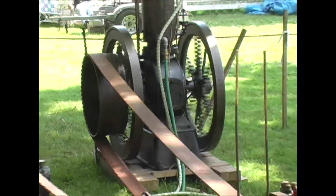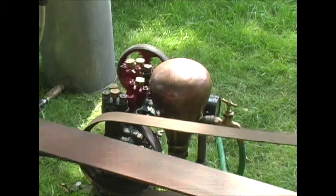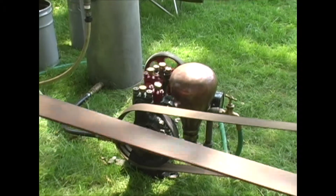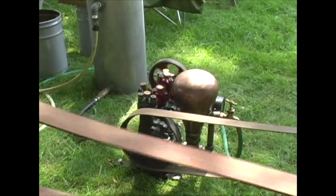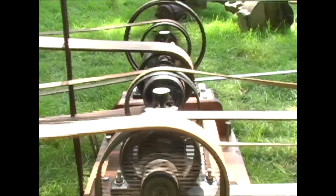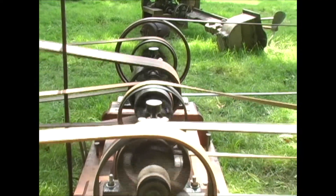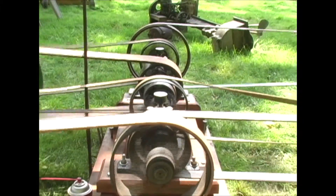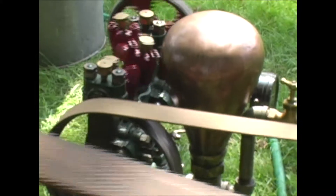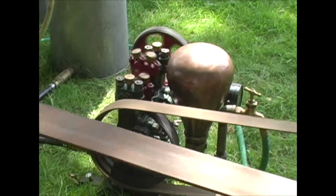All these belts have been running since eight o'clock this morning, and once we got them square and running, nothing is falling off. That's a water dome — it would equalize the pistons so you don't get a hammering effect as the piston pumps the water; it would actually form an air dome inside. That popping noise is the only time the engine actually fires. The engine is hit and miss — it only fires when it needs to to maintain a set RPM. Since there's no major load here, the engine is firing about every four cycles, so it's not using any fuel.